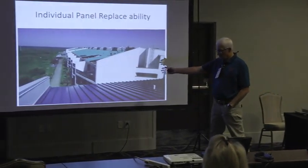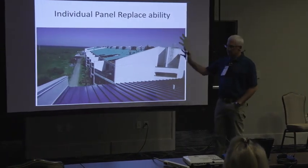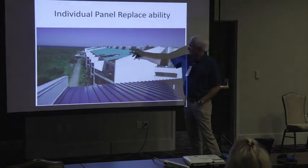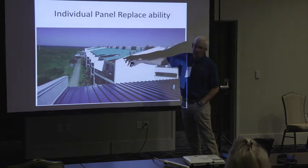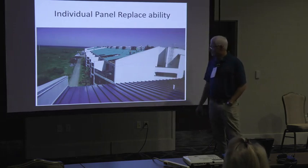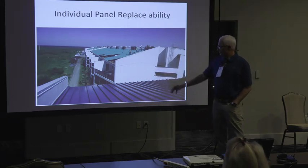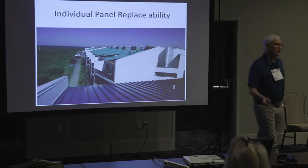This is a great example of what happened to you, right? This was after Hurricane Harvey. This was a building down in Port Aransas. They had, we're going to do a re-roof, remove and replace the existing roof with an R panel on purlins on a concrete deck. So we had done the first building here, which is going up by the beach. Took off the old roof, put down a brand new roof, attached to permanent 5-foot purlins. It was 100% continuous clips.